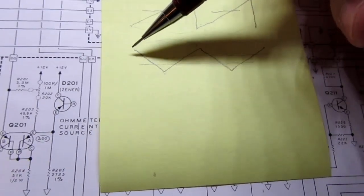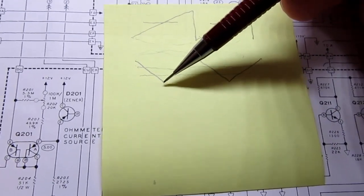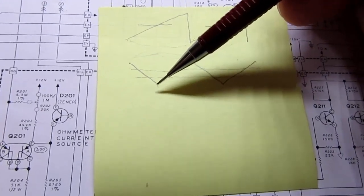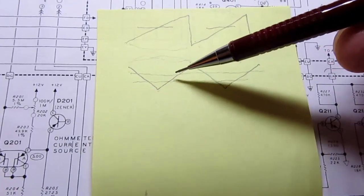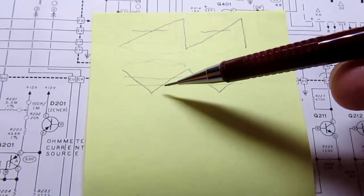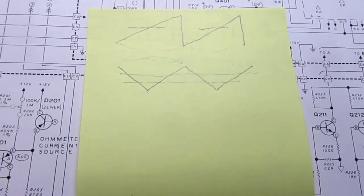So it's like doing a controlled test where you don't care about the input voltage or the input signal, and from that, from the rate of the slope, you learn about any changes that have occurred in the circuit, and then on the way up you apply those same standards, and therefore it compensates out any drift in the circuit, and it makes a more stable, accurate meter circuit.